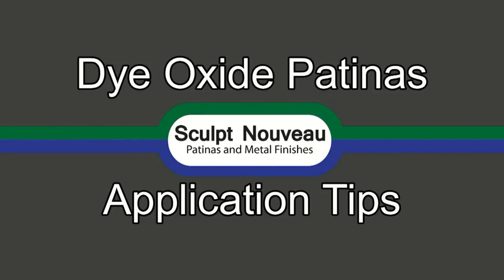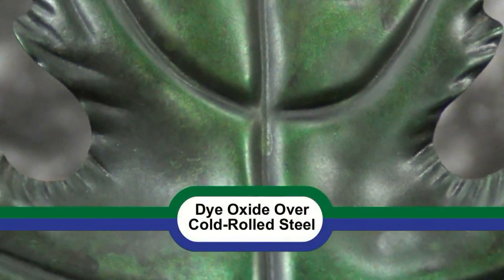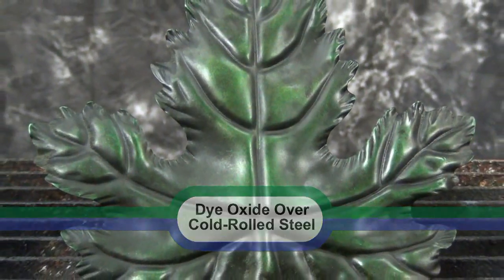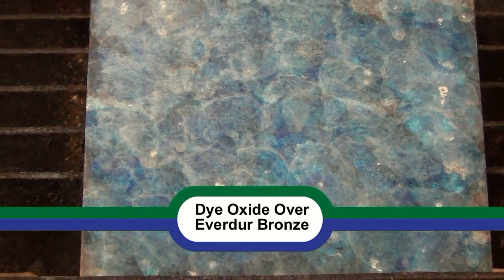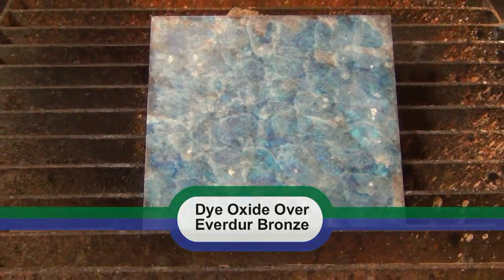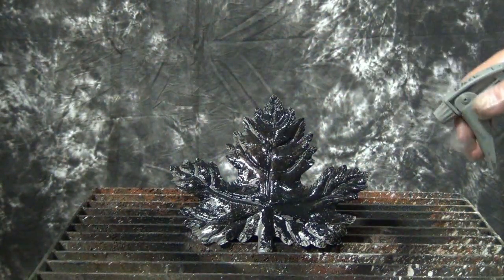The dioxides are one of our most popular products. The nice thing about the dioxides is they are an oxide, so they're very stable and transparent, and they have a very light binder in them. They have a lot of good qualities — they can either go over a patina or you could put it on the metal by itself, which could be any metal: bronze, brass, copper, iron, steel, aluminum.